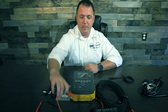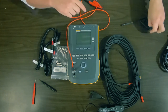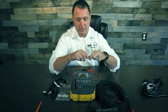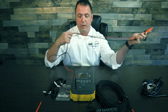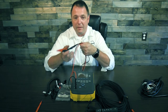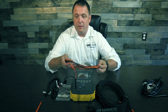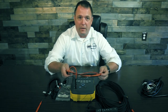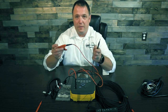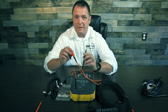One more topic: point-to-point testing. Using the two cables that come with the safety analyzer — red and black — point-to-point testing is required in most U.S. states for permanently fixed devices like MRI tables, CT tables, x-ray tables, and lab analyzers, especially after installation or repair. You need to check ground wire resistance and test for transient voltages and leakages. The problem is those two standard cables only give you about a six-foot reach, which often isn't far enough.